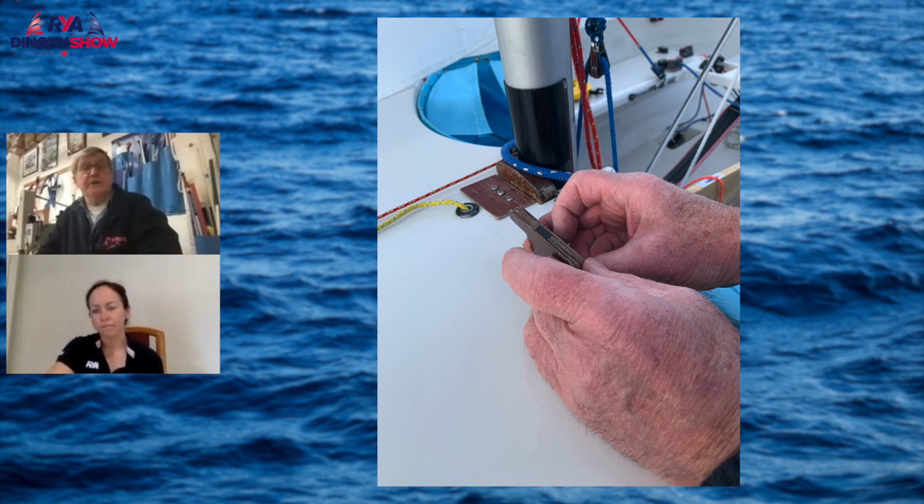In a breeze, I have the mast bent at the front this time, if you think about it, because I'll be spilling wind, the boom can be further out. Because the mast is bending, it's making the sail wider. Because it's making the sail wider, it will be making it flatter. Because it's making it flatter, it's widening the gap between the back windward side of the jib and the leeward side of the front, making the slot wider so more air can pour through it without there being backwinding. So light weather, no chocks, or 10 mm gap, fully chocked in mid conditions, back to 10 mm gap in a breeze. And the equivalent, of course, with a mast ram and or the strut.